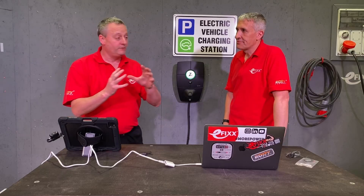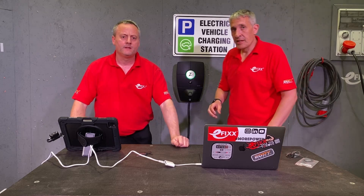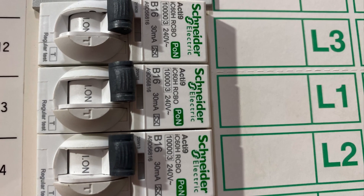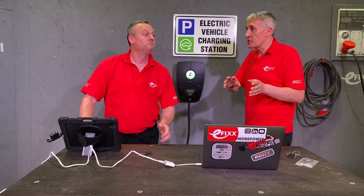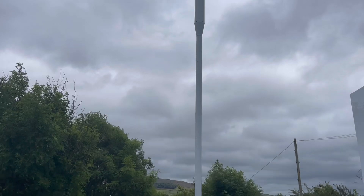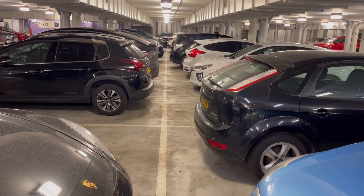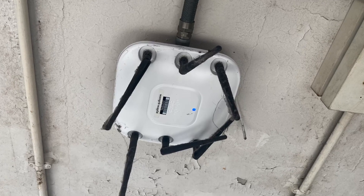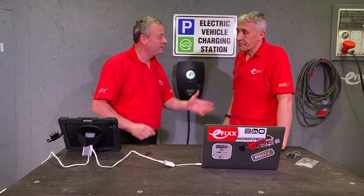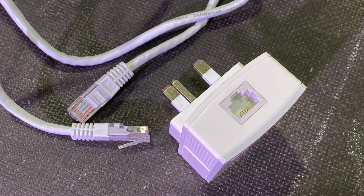I noticed you put that onto a single-phase socket outlet — so I'm presuming that data is now everywhere within Lineside Studios? It is on that phase, yeah. So we've got data over the mains wiring on the L1 phase, and with a bit of luck the Zaptec also takes the power for its powerline communication adapter off the L1 phase, so you don't have to add any additional hardware — it's all built into the charger. At the moment it's using 4G mobile connectivity, but why would you want to change? Well, you might be in an underground car park with lots of concrete, making it very difficult to get a 4G signal. You could install Wi-Fi access points but that can be quite expensive, and this looks like a really easy, competitively priced solution with no additional hardware cost.